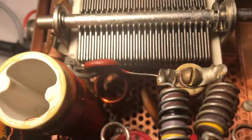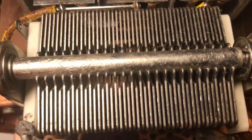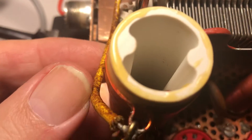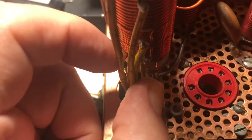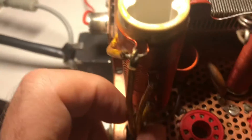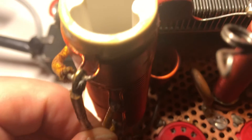I'm looking for things I can short in here, and I've checked the capacitors — they're not shorted. But I don't seem to get any load out of this thing, so I was trying to figure out the signal from this Pi network. It comes off of here and these are all tuned by the wafer switch. So if the wafer switch is malfunctioning, you're really in trouble.